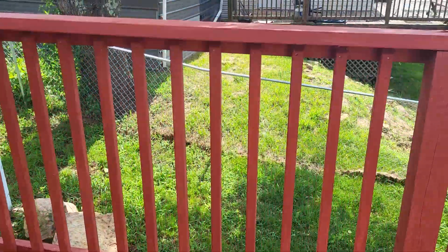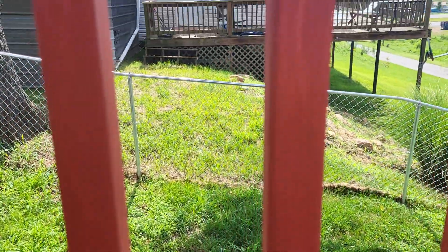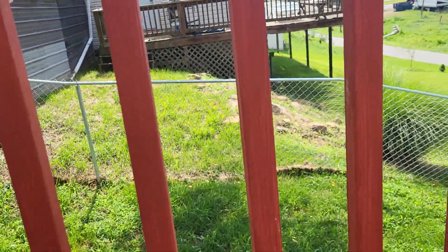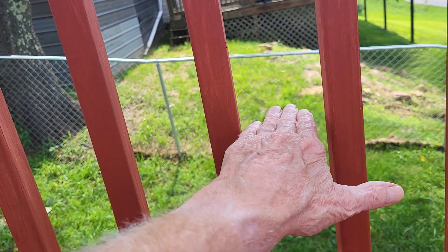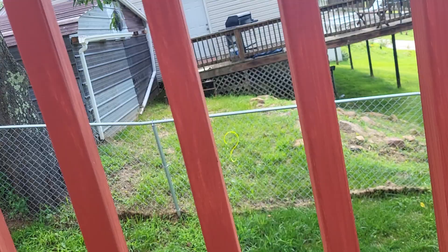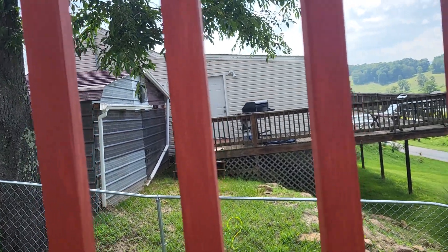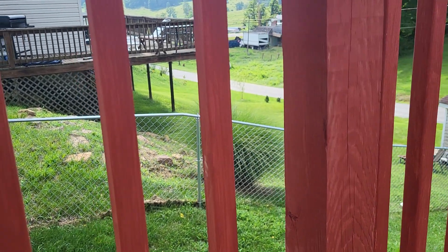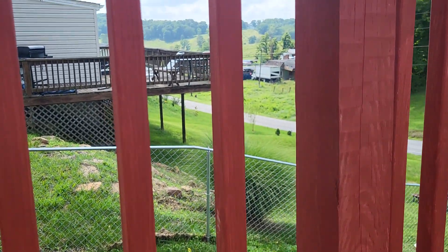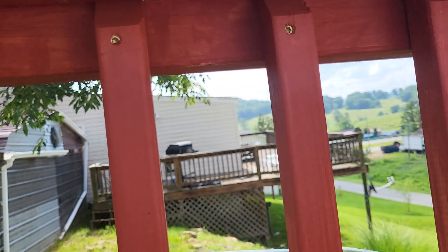As far as the pickets are concerned — which are these things here — a good way to keep them level is to use a two-by-four right in between the edge. You set a two-by-four sideways, with one that goes all the way from the top to the deck, set it down there and slap it up against the four-by-four. That's where you start, and you put your two-by-four all the way down and then put your pickets up there.